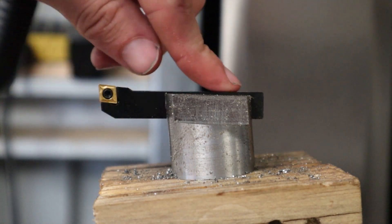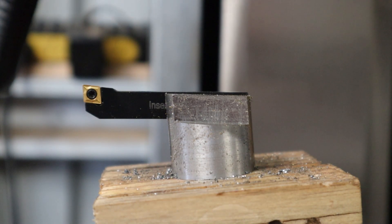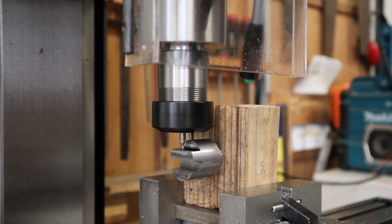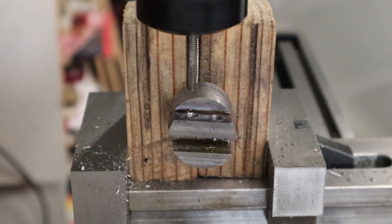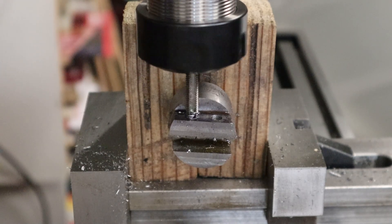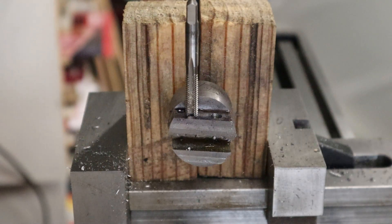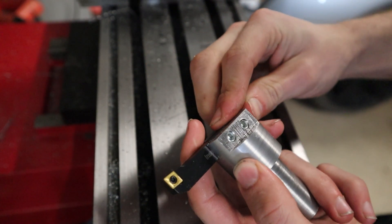When that was finished, I put a cut in the top to incorporate the 5-degree angle just so it looked better, then I test-fit the cutting insert. I then used the same blocks to hold the part at a different angle, spot-drilled and drilled two 5mm holes. These holes needed to be tapped with an M6 thread, and what better time to try the tapping feature. I loaded an M6 tap and put it in tapping mode — it didn't work too well, but I'm sure it would work better if I knew how to use it. So I just tapped the threads by hand, put the grub screws in, and it was finished.